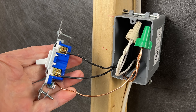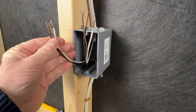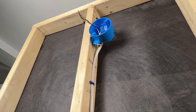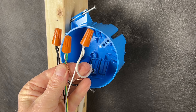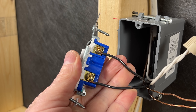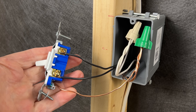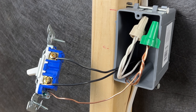The second wiring method commonly used for single pole switches is the feed-through method. We take our feed cable to the switch box first and then another two-wire cable up to the light box. We connect our two white neutral wires together in the switch box, which carries the neutral up to the light box where it's needed for the light fixture. The black hot wire from the feed and the black switch leg to the light connect to the switch. Ground wires connect together with a tail to the switch and continue up to the light box. This is a code compliant wiring method.